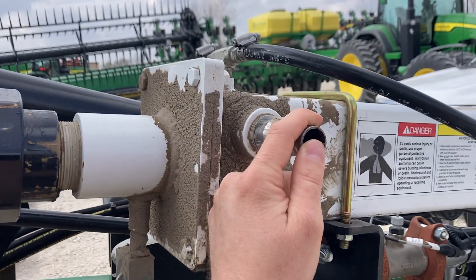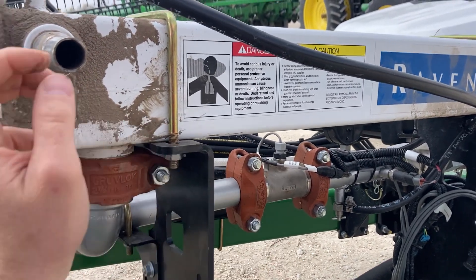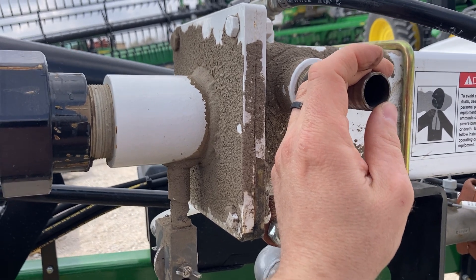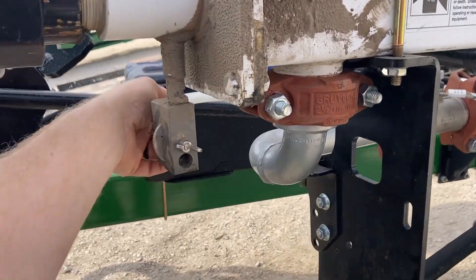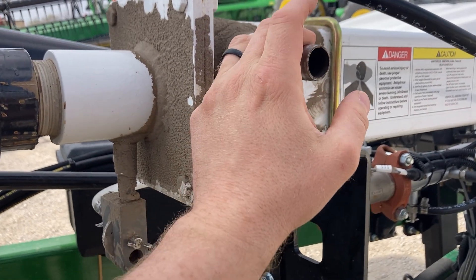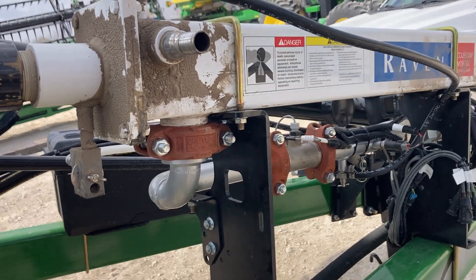The first thing is to have people pull this off. If there is vapor coming out, then maybe we start looking at other issues like a flow meter. There should be tank pressure — roughly half of whatever tank pressure is. So on a warm day with 80-90 pounds of tank pressure, you'll see about 40 psi coming out. With a 3/8 inch line supplied by 90 psi tank pressure divided in two, somewhere around 30-40 psi, we should see a good flow blown out of there. Until we get a good flow of vapor coming out, the cooler is not operating correctly.